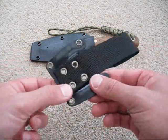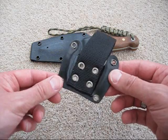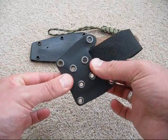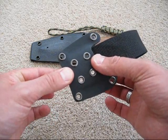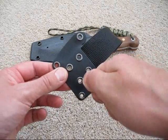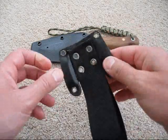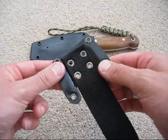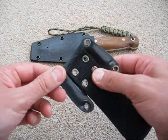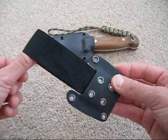That's why I used the cheaper ones — just for speed, just to get it finished. I've drilled the four holes, put the rivets through, and what I've done is I've heated up an old screwdriver in a heat gun. I went in from that side, clamped the webbing with a little vice clamp, and then just went through with the hot screwdriver straight through the webbing, cleared the hole, pushed the eyelet through, put the washer on, and then squeezed it to form that belt loop. And it worked out quite well.